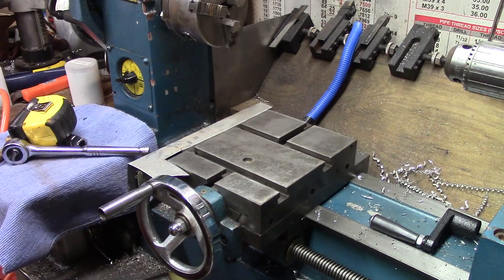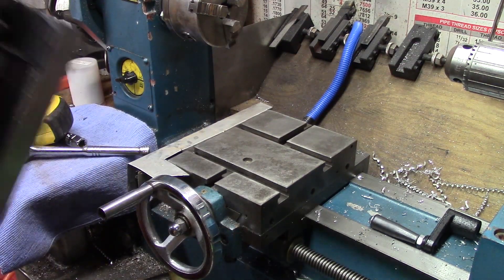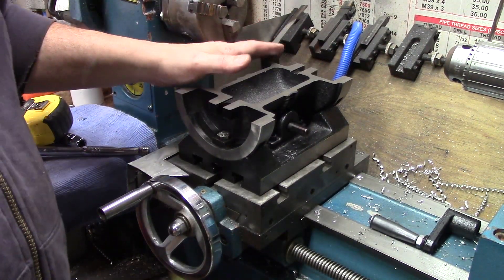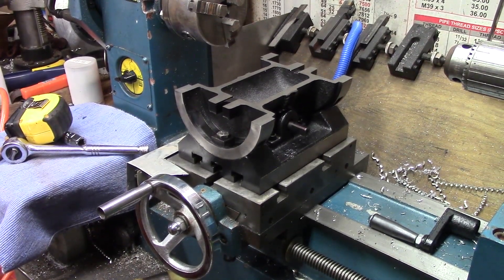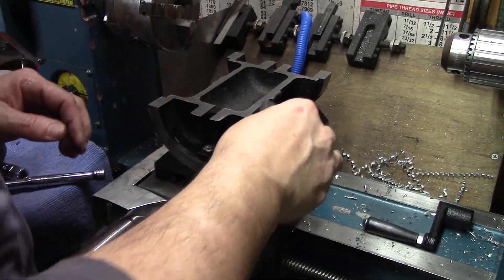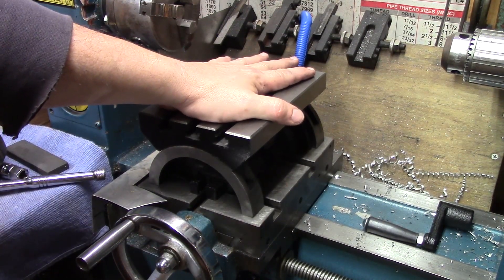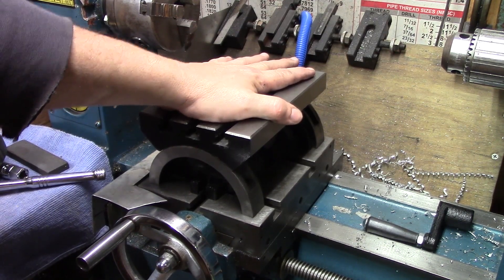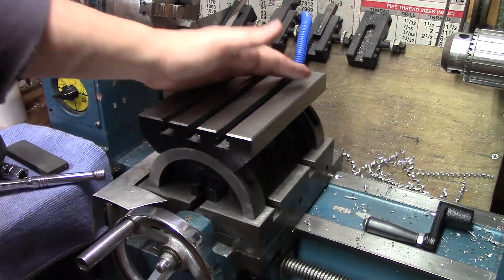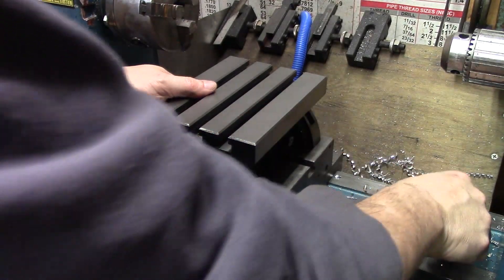My table is pretty flat. Let me put the plate down on top of it and see what it does. The plate's pretty flat — maybe there's a little burr causing that. Let me quickly stone it and take off some of these sharp edges; they're pretty sharp. Still got that wobble in it. That's going to have to be addressed. In the interest of full disclosure, that's not great.